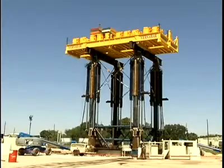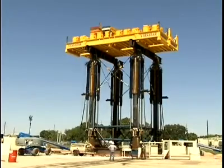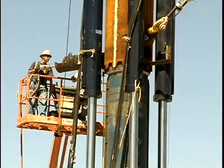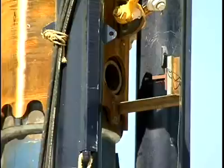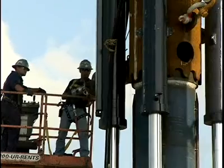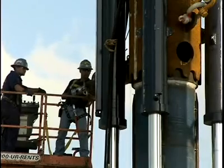Another unique design feature is our ability to pin off. At any time during the project when we're not jacking — while we're welding — we can have a positive block on our legs by having a pin inserted through the legs that's designed to withstand hurricane force loads.